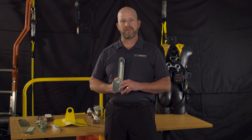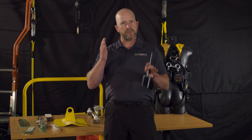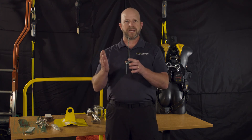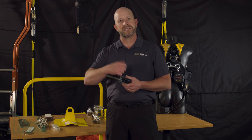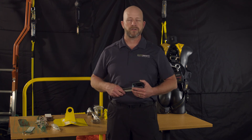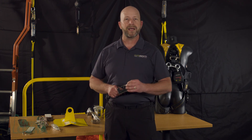It must be evaluated either by a competent person or by a qualified person. Laying one truss doesn't make it structurally sound, and at some points you will need to have somebody do actual engineering or prove it is capable of withstanding the forces. We've talked about working on top of a top plate where framing is up — but can it sustain the loads of a dynamic fall without pulling over? If the anchor is only attached to 26-gauge material and the manufacturer requires 12-gauge, then it won't withstand the forces it's designed to apply. Always select the right tool for the job and ensure workers install it the appropriate way in the appropriate place.